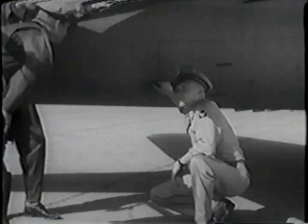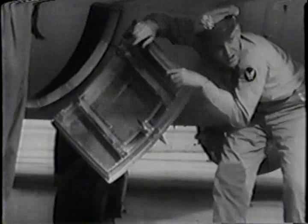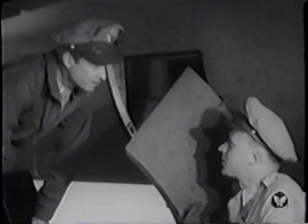And while you're here, it's a good idea to see if you've got an elevator downspring. If it's on the airplane, you can see it easiest through this tail gunner's hatch. You see it up there in the elevator control arm? Yeah, don't all B-17s have them? A lot of them do, but you should check to make sure. Downspring will affect the trim of a ship, especially on landing.